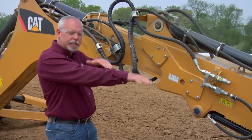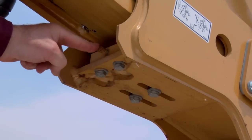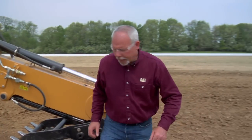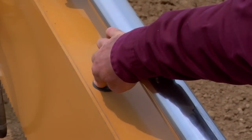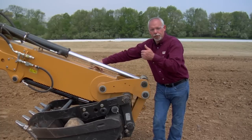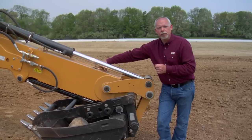But we also have a top to bottom where it'll wiggle this way. With that, we have a shim down here — it's a wedge block and a couple of pinch bolts that we adjust here to take care of one side of that slack, and then we're going to walk right over to the back here, and we have a cover plate back here. You're going to remove that plate, and you're going to have a shim similar to the one on the back side there. You're going to remove these two plugs up in here, loosen those up and adjust your shim. If you make it too tight, it's going to make it jerky and sticky, or may not even move at all, but you want to get that slack out so this thing is not wagging its tail when the operator is trying to dig his hole.